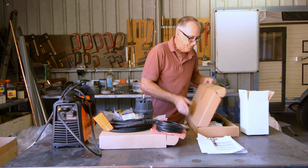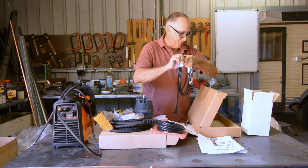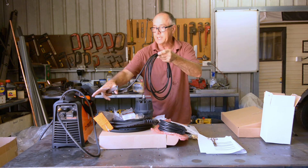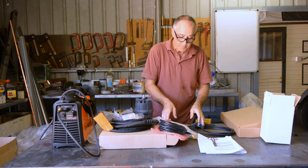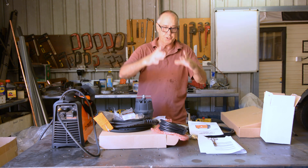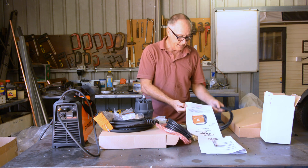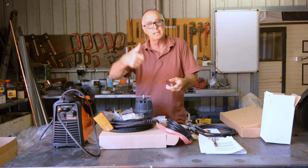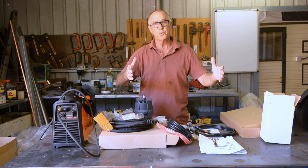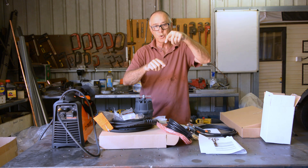Lastly in the other box — there we go — there's the air hose connection. And we also have the earth clamp, or return clamp, that goes onto the workpiece. This is the clamp that goes between the cutter and the workpiece. On my table I've actually got a common grounding plate. The cable from the machine goes to a grounding plate, and then I've got a lead with a magnet that goes to the metal I'm cutting. For aluminium, I've got another lead with a clamp so you can clamp directly, since the magnet might not hold. I've also got a cable from the common plate to the side of the water bath — so if I forget to put my clamp on, I've still got a return path for the plasma cutter back to the machine.